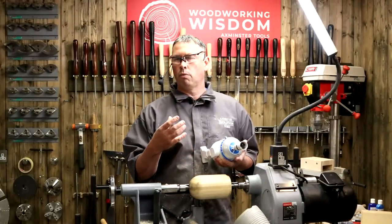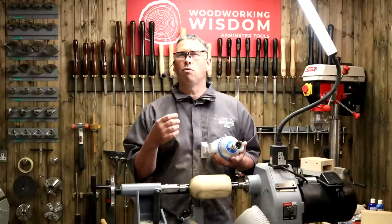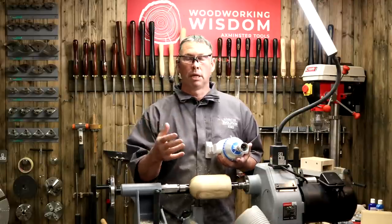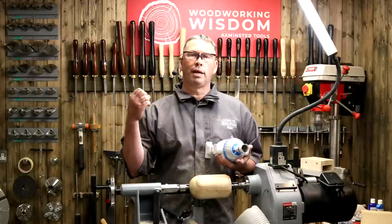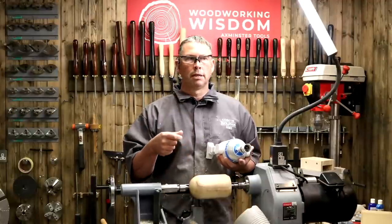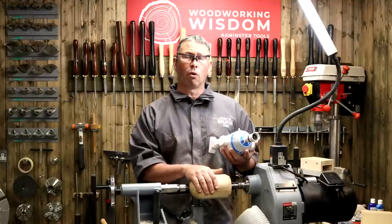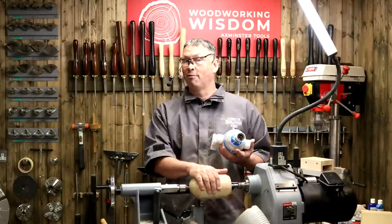Anything where you want to harden the timber up, that sort of thing, then absolutely. I tend to go with a thinned version, so I'll say 50% maximum with the thinners, purely because then it can soak in a lot further. You might have to put a couple of coats on, but it will soak in a lot further, especially those really dense exotic timbers and the ones that are waxy. It'll eat through those waxes, going a long way and really benefit the turning. That's drying nicely now. I can feel the nap, that grain come up.